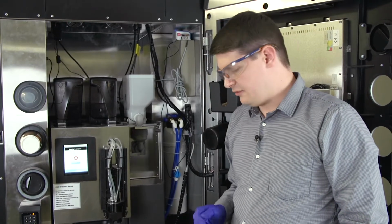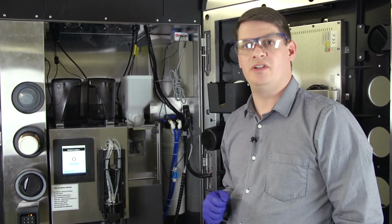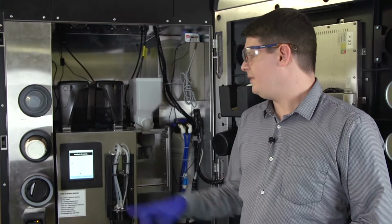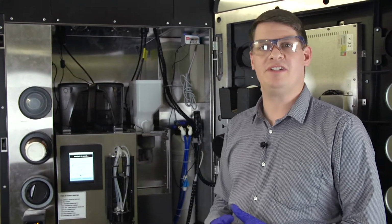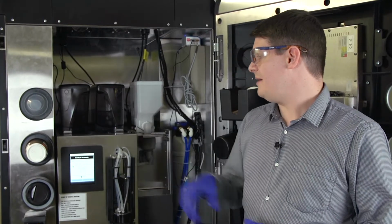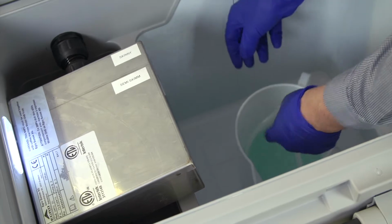The water will now flow into our milk cleaning solution and dilute the milk cleaning solution and clean through our milk tubes. Once you've completed the 4th step, the machine will start to put itself into a standby mode and give you a countdown of 30 seconds. We're going to do the final step, which is to remove the tubes and place them into our container.